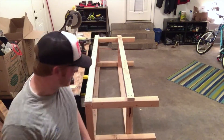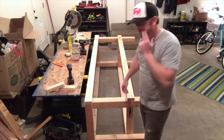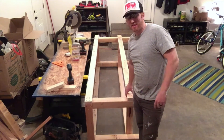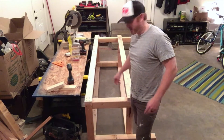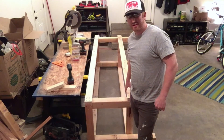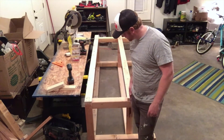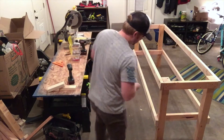All right, so now we've got all the supports on. I want to put the first level shelf on next. I'm going to stand it upright first, get through every step, stand it upright, put that level on, and then the top — because that's going to require some cutting and measuring, and I don't want the weight of the top on it yet. It looks like we're going to cut in about three and a half inches.